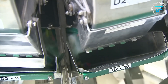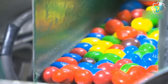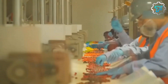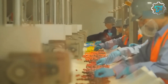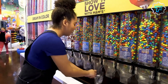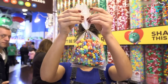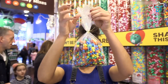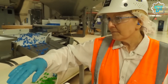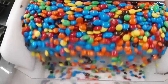After the chocolates have been sprayed to satisfaction, they are covered in one last coating of syrup, which contains coloring as well as sugar and corn syrup. In each spraying batch, the final syrup includes a different color corresponding to one of the different M&M colors. Since there is more than one panning machine at the chocolate factory, different batches are sprayed at a time, so all different colors of candies are produced at once, which speeds up the production time.